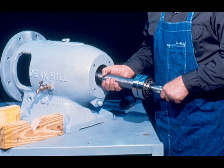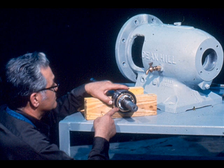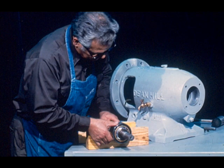Now remove the shaft with the bearings on it from the bearing housing. Once it has been removed, inspect the bearings very closely. As we mentioned earlier, the condition of the lubricating oil is a good indication of your bearing's condition. If the oil was clean, the bearings may sometimes be reused. However, you should check them very carefully for roughness before you do so.